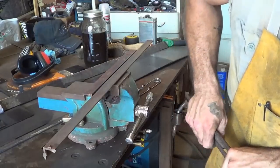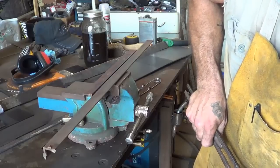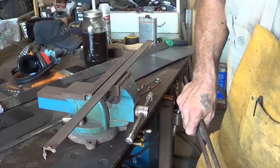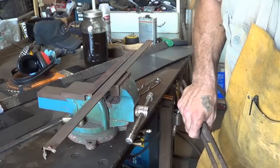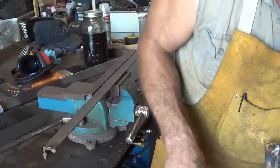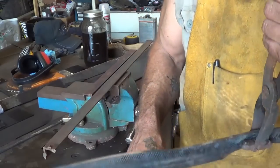So we got, yeah, see that's a little bit more what I want. I want flexibility back here and that golden. This blue down here doesn't make me happy, but it doesn't make me extremely upset either. That's the weak spot anyway. And then this is our main chopping area. So I'm much pleased, yeah, gold straw. This got a little bit too much, but I'm okay. Alrighty, so there we are, tempered up.